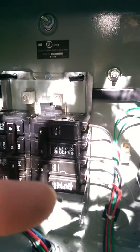This was the one that was over there — 480 to 240 — same thing, you get weird voltages per phase. I don't know if this is an issue, but it's not really an issue because the lights work. But you can't just do 120 off of each phase, because it's not 120 to ground — you'll blow your equipment.